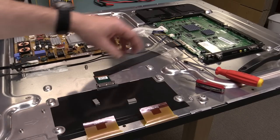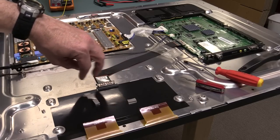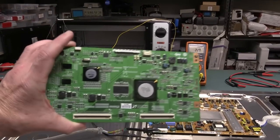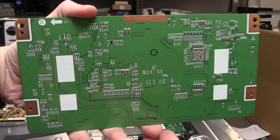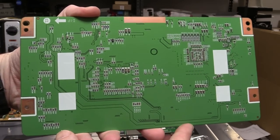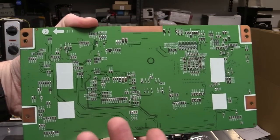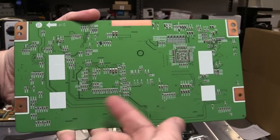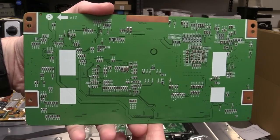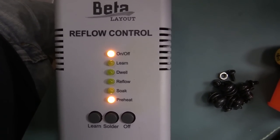I'm not sure what the actual failure modes are with this particular Tcon board, but yeah, Tcon board is a classic culprit in this LCD scenario. I've tried the flat flex ribbon — I've gone to town on this flat flex and I can't find any issues. This is actually a double-sided load, so ideally you want glue on the second side components. I can't actually see any glue on these but we'll give it a go — most likely there are tiny little dabs of glue on them. The surface tension of the solder should keep the components there on the bottom since they're only very low mass.